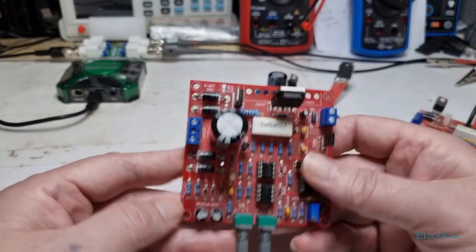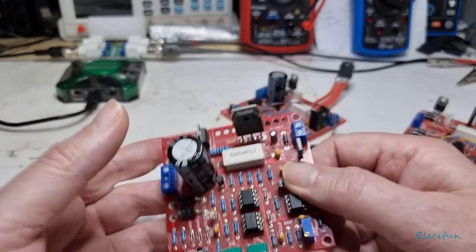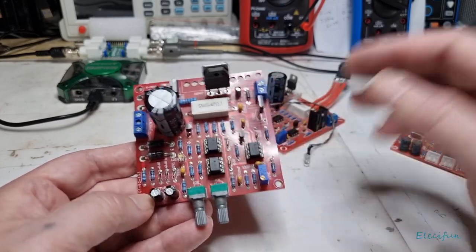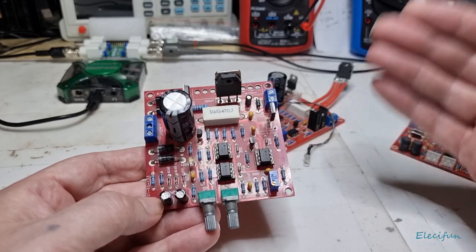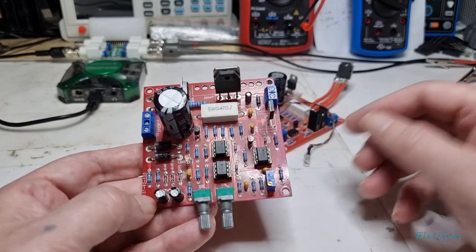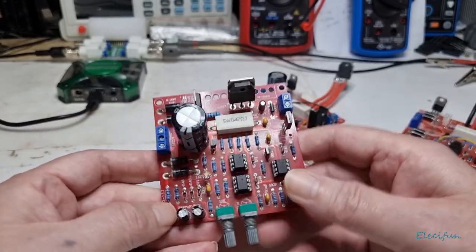Other people have left comments saying you can directly connect a DC input to the supply capacitor — that doesn't work either, because these ICs are differential input, which means you need a positive voltage and also a negative side of the voltage as well. So for example, two times 16 volts, or plus 15 and minus 15. And that's what this little bit of circuit down here does.